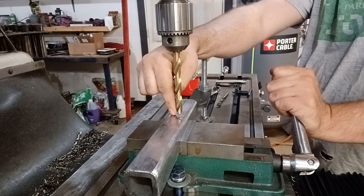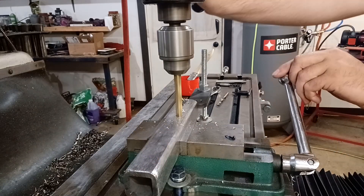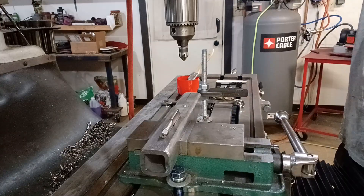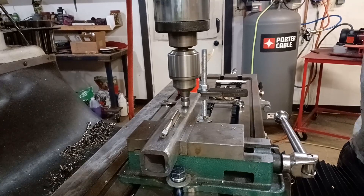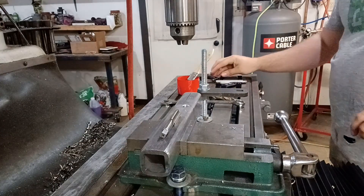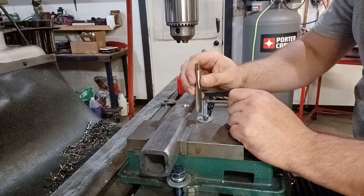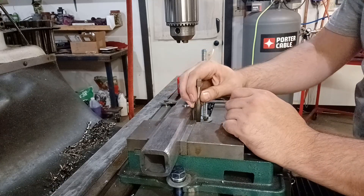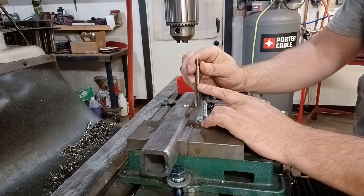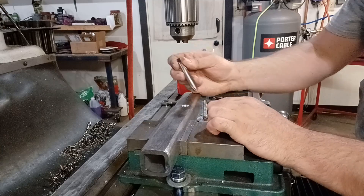We're going to drill this hole at about 650 RPMs. It's important to go all the way through both walls. As much as I love the YG Spiral Flute Taps, in this situation I need one with a very long threading section because I have to get all the way through both sides. You can't thread one side, flip it over, and thread the other side — those threads will never line up. You have to start on one side and go all the way through both walls. The spiral flute taps are typically not as long, which is why I have to use a longer tap here.